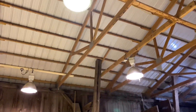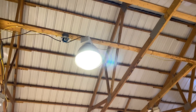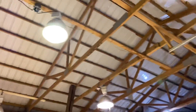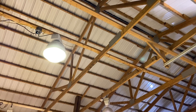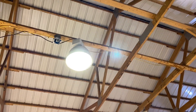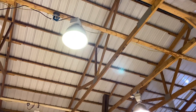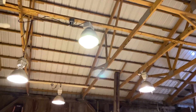The halides didn't take so long, and those are 400 watts. The mercury vapor bulb is 250. Just a side note — even though this fixture's ballast is intended for a metal halide like the rest of them, you can put a mercury vapor bulb in that fixture with that ballast. It's actually easier on it since it's not as harsh. Just don't put a halide in a mercury vapor ballast, though.